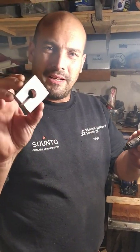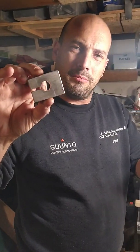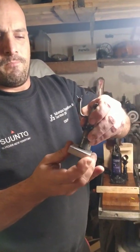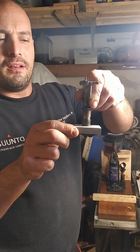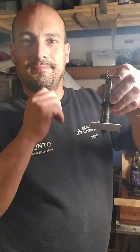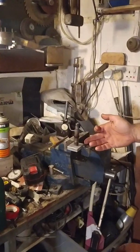With the tool that I made — it's a piece of aluminium, the diameter is 17 millimeters — I can put the injector here and with a bench vice I can unscrew the injector without damaging it. This is a simple setup of how I use my tool in a bench vice.